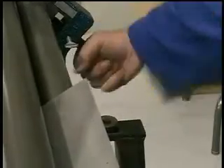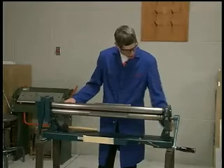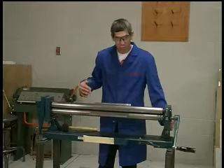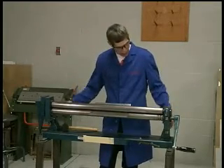So I'm going to roll it up here. As I approach the zeros on both sides, these numbers don't really mean anything as far as the amount of bend goes — they just help you keep the two rollers in relative alignment to each other.